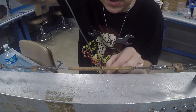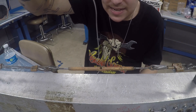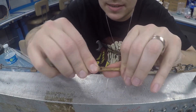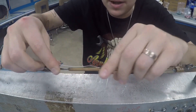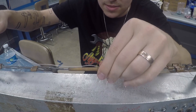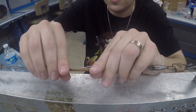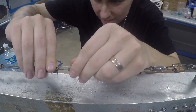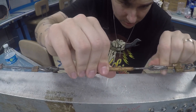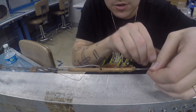You want to go through the center hole and bring the safety wire where there's an even amount of wire in each hand. Then push over and bend it here and here. You want about a 90 degree bend, as flat and straight as possible. Okay, then come across over here to the other side and go in through the eyelet of the turnbuckle.